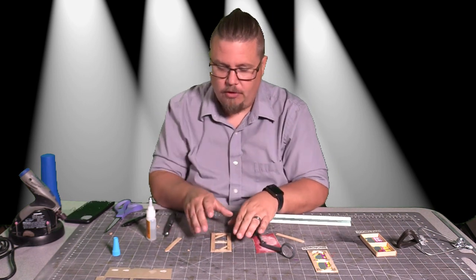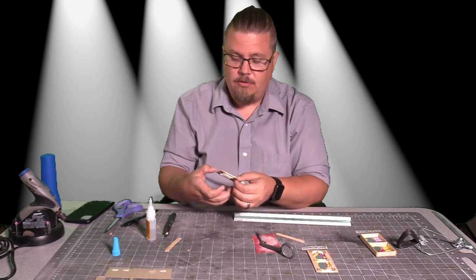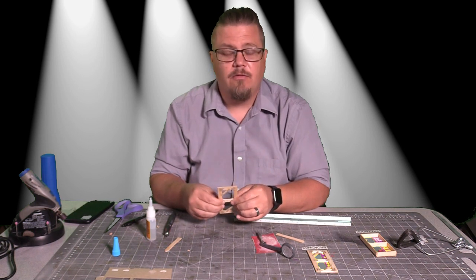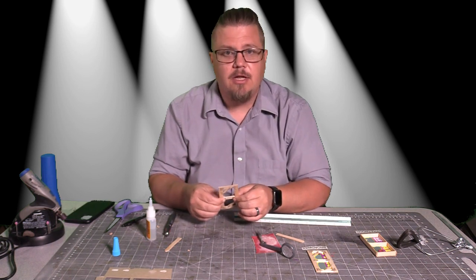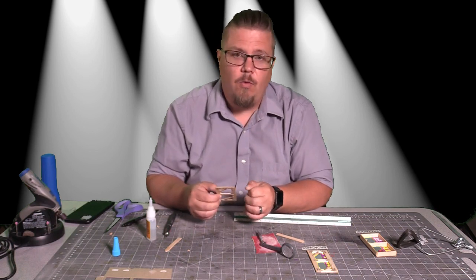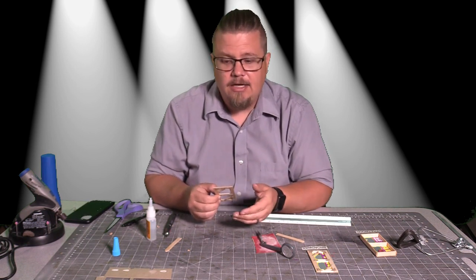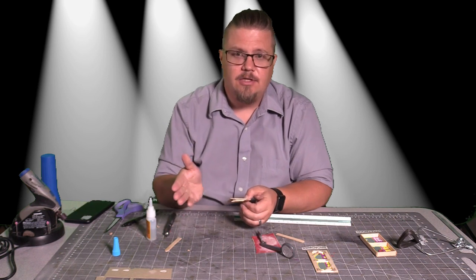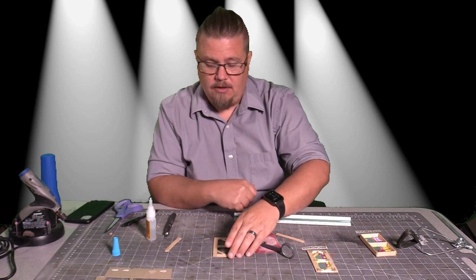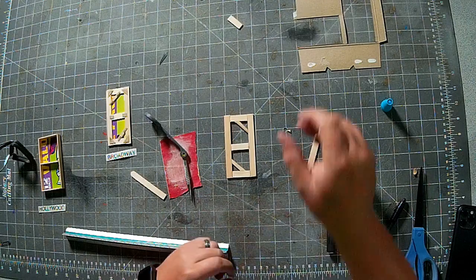All right, once you have all of your pieces glued together and they're dry, it's time to create the covering. Now, many flats are covered with fabric or a muslin, especially in the theater to make them lightweight. Sometimes they're covered with traditional drywall, like in most Hollywood sets. And in our case, we're using a piece of box to cover ours. In my theater, I typically cover it with a piece of 1/4-inch wood, either hardboard or a luan.